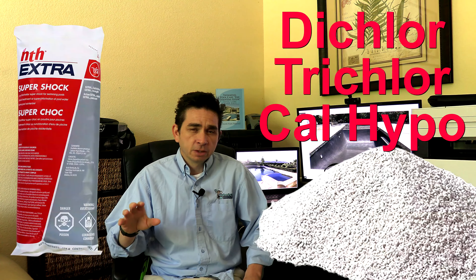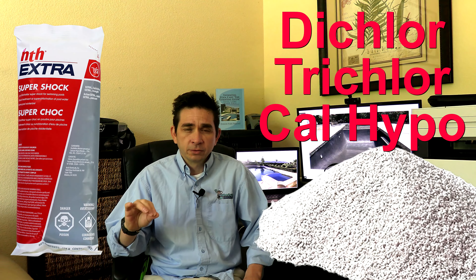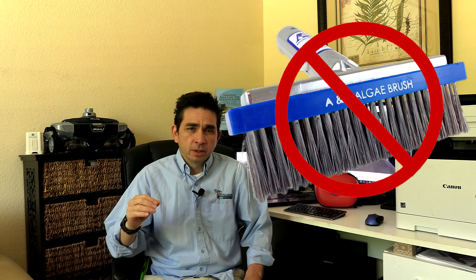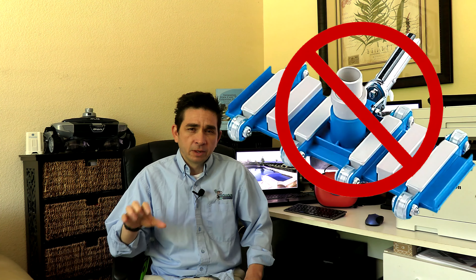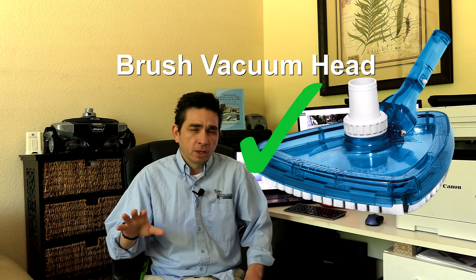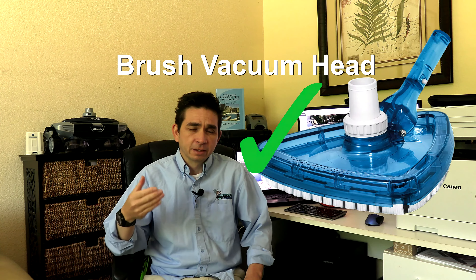The most important thing to note about pool surface types is that some are more susceptible to staining and tearing, like the vinyl and fiberglass pool surfaces. You want to use caution with vinyl and fiberglass — do not add any kind of granular or powdered chlorine to them, as this could stain the surface. You also don't want to use any kind of stainless steel brushes in a vinyl pool, nor do you want to vacuum a vinyl pool with a regular wheeled vacuum, as this could tear the liner.